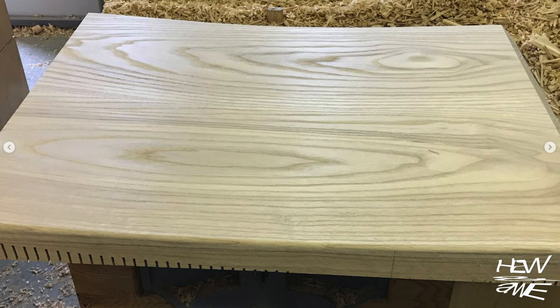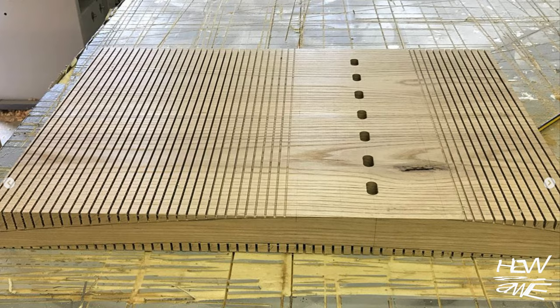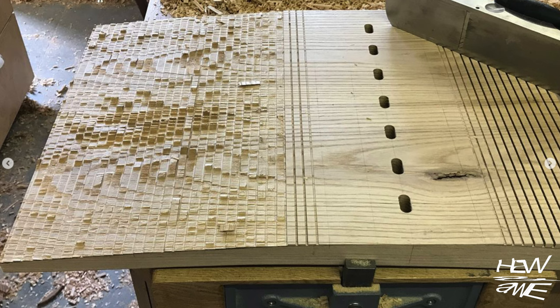As I'm recycling these legs I don't have any film or footage apart from pictures to show you how I made them. I used the track saw to give me my depth gauge as you'd call it, then hand-planed down to that line. I did try my best to smash as much of that waste out, but that made it a lot more difficult with the hand plane because the hand plane is just skimming off the top of those pointed bits. It did take forever, I can assure you.